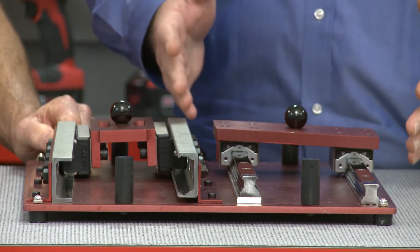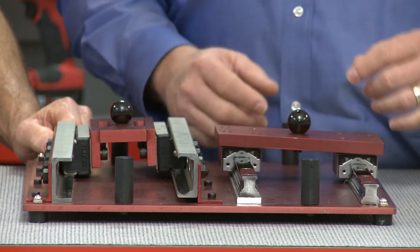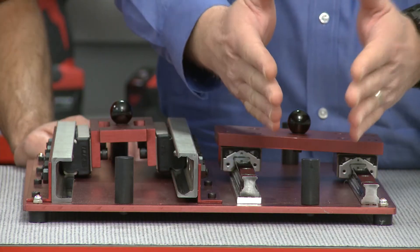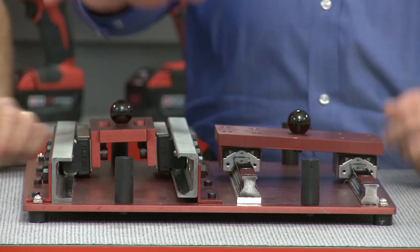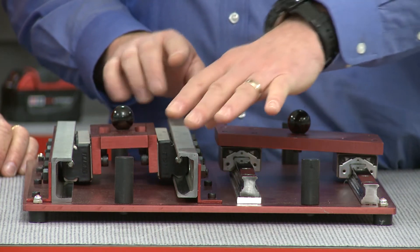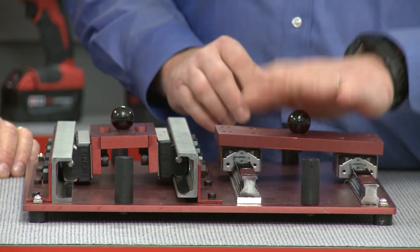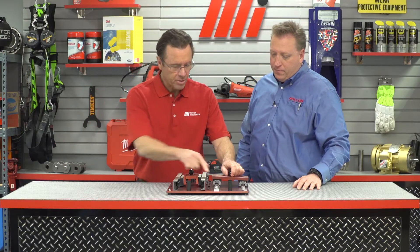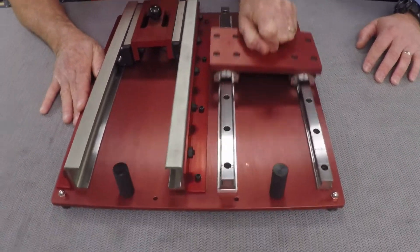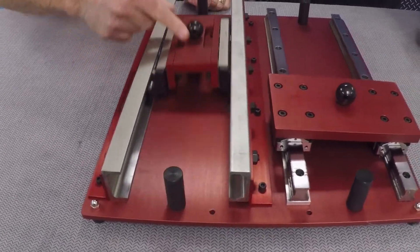So this is a demonstration we've created. This is a typical linear rail system — two blocks, two rails. This side of the rail, we've raised it 4 millimeters and pinched it in 4 millimeters. This is the Roll-On compact rail product. We've done the same thing — raised this rail 4 millimeters and pinched it in. What I'd like you to do is move this compared to the Roll-On. You can see how both were raised. Oh wow, that's really hard to move. Oh wow, that one moves really easy. That's amazing.